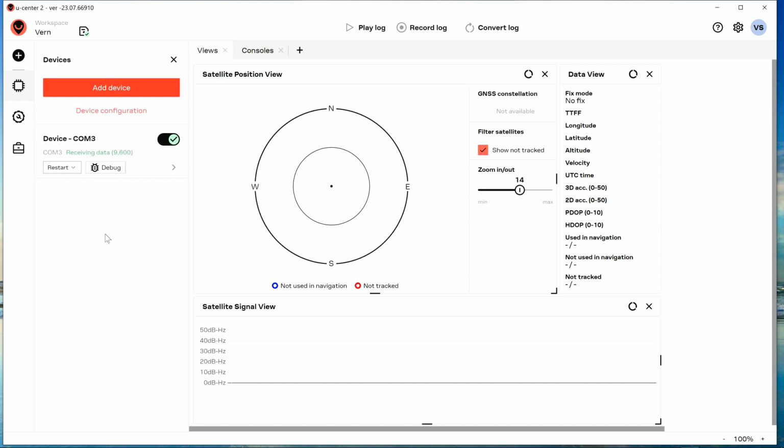The almanac information that's in the RAM has to be checked against what it can see in the satellites in the sky, and there's a way to do that. So there's still going to be some startup delay. After it figures out that its almanac that it has stored is valid, then things will take place quickly. And the requirement to download that almanac from the SAT system at a slow rate is eliminated. That's all that iFlight's doing.